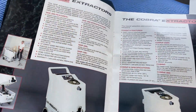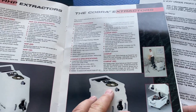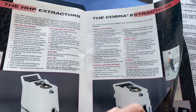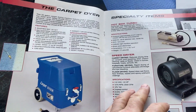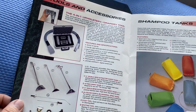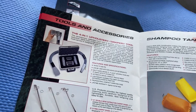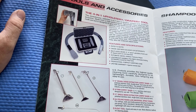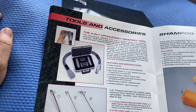I know some of you have started watching my videos and maybe didn't go back into my archives. I actually did show a video where I opened this machine up and did some repairs on it. When I got it, the carbon brushes were almost worn out. It has about 700 hours on it — the motor was in great shape other than the carbon brushes, so I just replaced them. The pump had a little leak which I was able to fix without any problem.